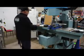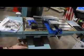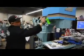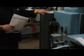I'm going to have you give me one wrap-around on the machine here — I want to show off some of the last features. We have a heavy-duty table here; all the specifications are going to be shown on the website. What you're seeing on the table here is a 17 by 36 and a half. I have 32 in the X, 14 in the Y, 5.5 in the quill. I'm currently set up with the fixed knee; however, in the future you can add an optional knee elevation motor. This is the prowess of the machine tool industry when it comes to a setup of this nature. I'm also showing off the Quick Switch number 200 series tooling — changed in and out essentially with a wrench, very quick, very fast. We have a spindle air brake on the machine as well as an automatic lube package. The automatic lube package ties in with the spindle air brake. And on the rear, of course, is your Centroid controller.